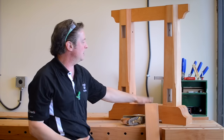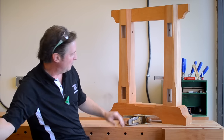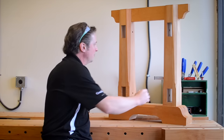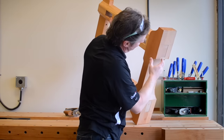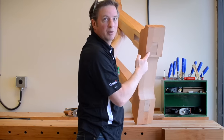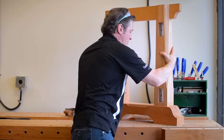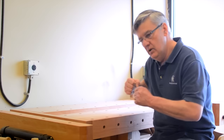We also laminated the feet the same way, leaving holes for the mortises for the base that come right through the bottom — you can see those right here. It's a very quick and very strong way to build. You can plane on this bench and it doesn't give an inch, which is the important part when you're using a hand plane. You've got to have something solid to run across.